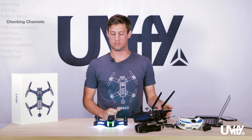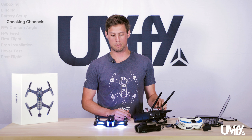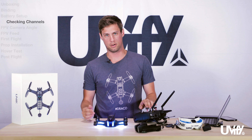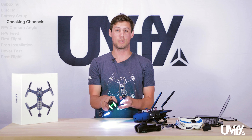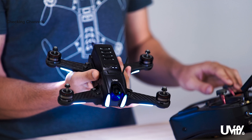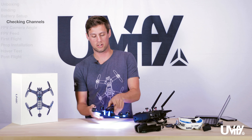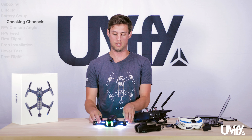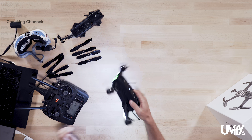For my drone I have a switch on the back that arms the drone, and then I can check my channels by moving the sticks — throttle up or down, right or left, forward back, right or left. Since you don't have the props on, stick it in your hand while doing these movements and you'll be able to feel it trying to turn. As long as it's reacting roughly correct it should be okay. We still advise you to check your channels within the configurator itself.